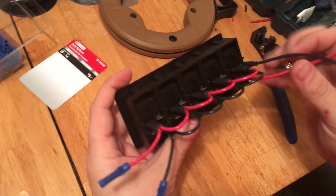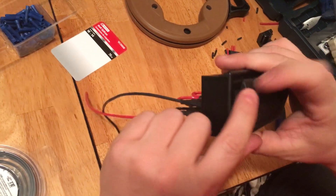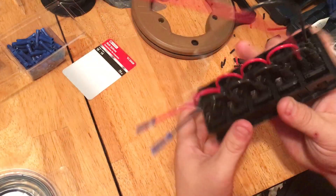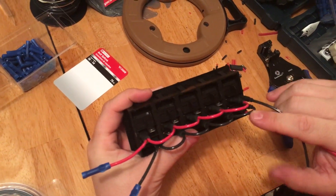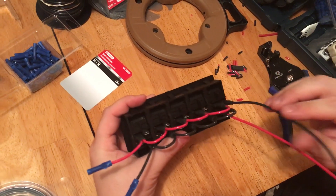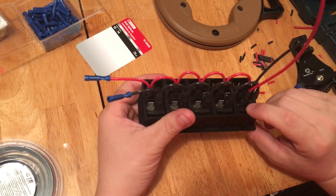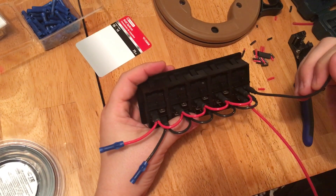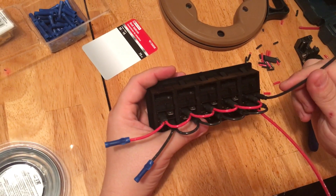I'm going to be using this to power my light bar on my boat. So when you come over to this last panel — the one I'm using for the light bar — you have the battery input daisy chained in, and then going out you have a positive and negative that go out to the light. The positive going out to the light goes to the bottom left terminal on the rocker switch, and the negative cable goes to the top right terminal.